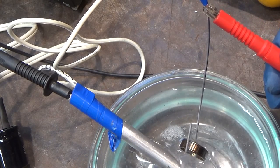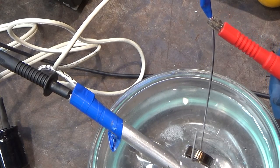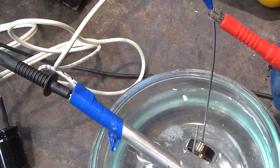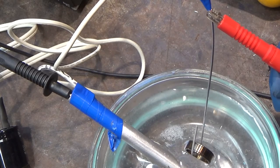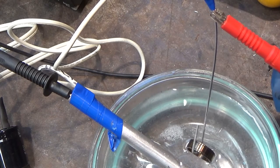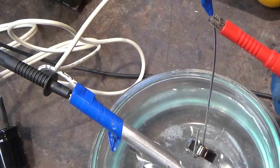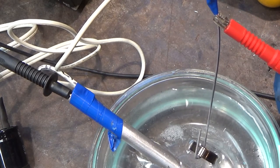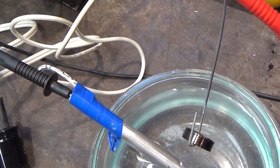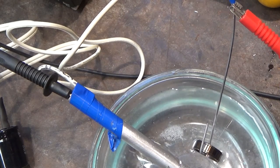It's starting to darken a little bit here. So it's sort of at a yellow color. So I think, again, we're going multiples of wavelengths with the oxide layer thickness. All right, so I think the next step is to head up to about 25 and see if we can get a nice blue out of it, because I think that's the color my wife likes.